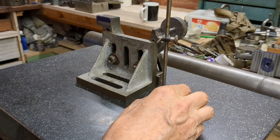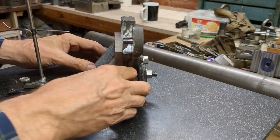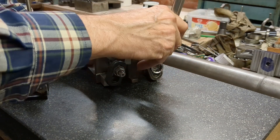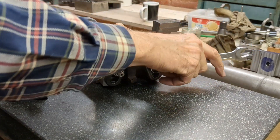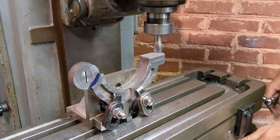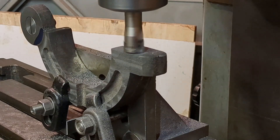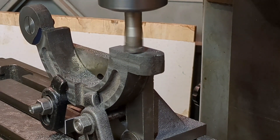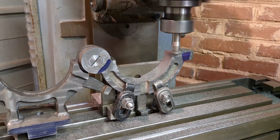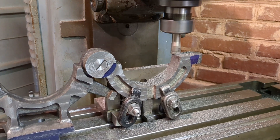For the next operation I need to set the work up on an angle plate and it needs to be leveled with the base of the angle plate, so I'm picking up the centre of the pin and lining it up with the surface of the clamp. Unlike the base, which is a nice flat surface I can mount directly on the table, I need this setup for machining the top half to get the clamping surface level. I'm now machining a 20 thou or half millimetre relief so that the clamping action is only in the area of the bolt.